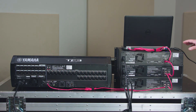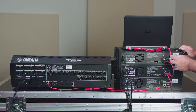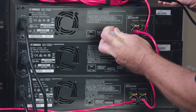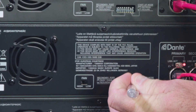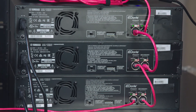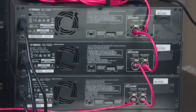Now that you've made your changes, you'll need to go back to the dip switches on the back of the 1608 and put dip switch number seven down on each unit to put it in resume mode. Resume mode means it will always come back at the same setting you're leaving it on right now. All you need to do then is power cycle and you're good to go.